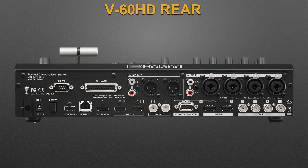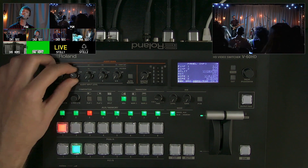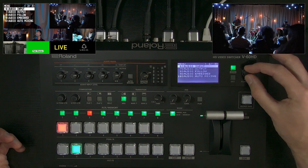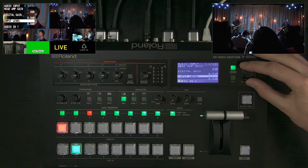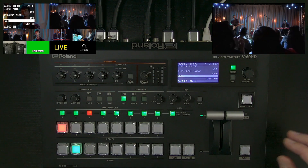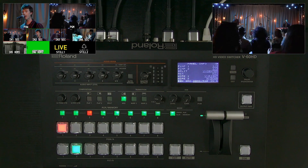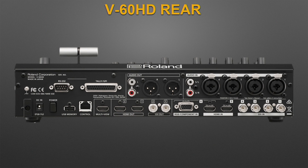On the audio side, there are four XLR-TRS combo inputs, and inputs five and six are stereo RCA line in. These knobs are faders, not gain knobs — to stage your mix, bring sources to 0 dB, then set the head amp gain (preamp gain) for mic inputs under menu > audio input. You can also set phantom power and pan control for the four inputs in the menu. Line inputs five and six have a stereo fader. There are also audio output and de-embedding settings in the audio output menu.